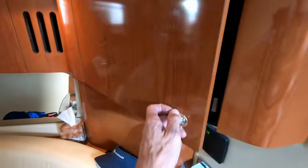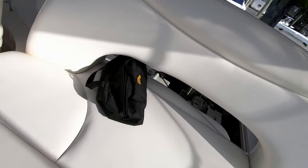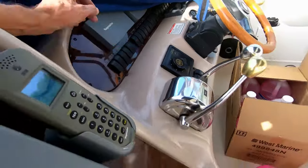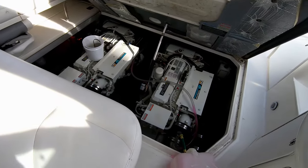I'm just going to turn on the starboard engine so I don't make any mistakes. This will only take a few seconds to transfer the pink through — we've got to watch the level in the tank and make sure we don't let it run dry. I can see the pink going through. I don't want to spill a ton into the bilge either, so I'll let it kind of finish and then shut it off. Alright, the starboard engine is now winterized. Let's move on to the next one.